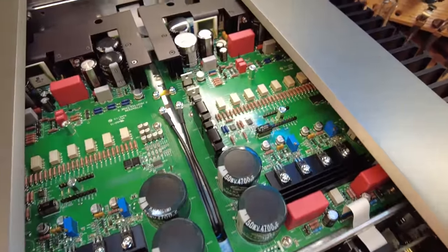Now we've got the unit flipped over. It's quite an ordeal at 38 kilograms, but beautiful casework on the bottom as well — this is where manufacturers usually cheap out. We've got the end caps, probably about three-quarters of an inch thick, and the same sort of sliding bottom plate. A couple of screws gives us access. Now inside, I was wrong about the dual mono claim — the amplifier section has a single toroidal transformer for both left and right channels, not uncommon, but I want to make that correction. Massive toroidal transformer — absolutely beautiful — 1,000 volt-ampere, encased in some sort of ferrous material or aluminum, potted and beautifully laid out.